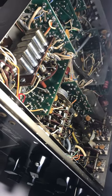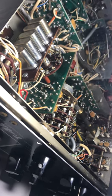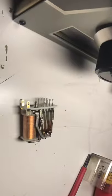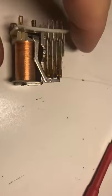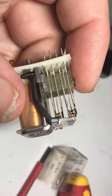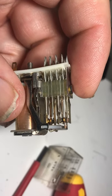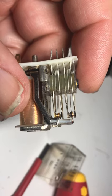I finally got drive again. The plate on the finals was dipping — I thought it was working. But I had no output from the SO-239 jack in the back. So I pulled the relay, thinking it carries all the RF current. And yeah, it looks pretty smoked. People want 50 bucks for these on eBay now — some ridiculous price — and this one looks like it's toast.